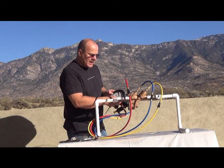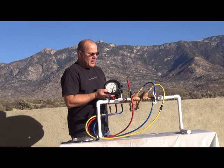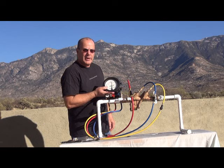We're going to shut off our number two shutoff valve, then shut off the high side bleed valve and the low side bleed valve, and look at our apparent reading. The apparent reading is 8.0 — it's above five, so we can continue.